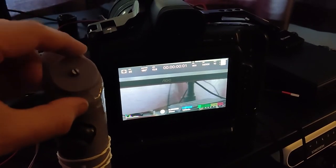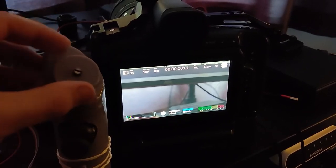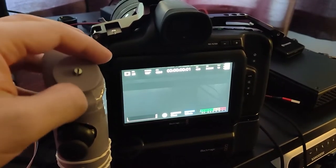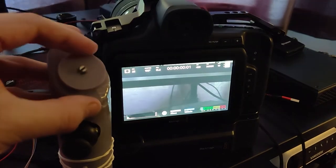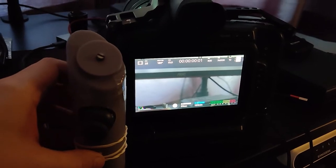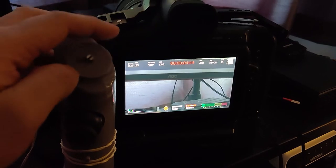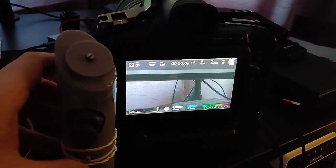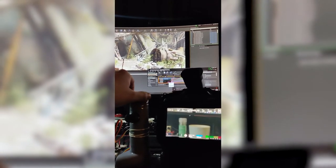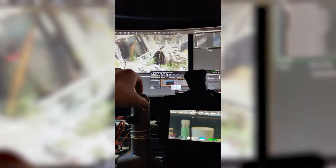The Bluetooth is quite challenging. There was a specific library that needed to be used, so it needed to run on 1.0.4 or 1.0.5 version of the platform, essentially, which is not the newest one. We needed a specific BlueMagic32 extension or library. And it was very finicky to get that working. So luckily enough, we managed to get that working after quite a lot of frustration, and it works pretty well. And you can see that pretty much on the screen right now.